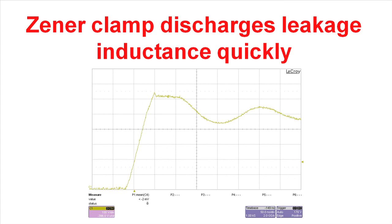In this view graph, we're going to look at the drain voltage of the MOSFET, and we're going to present two different pictures. This first picture is with no resistance in series with the diode — so simply, all we're doing with the clamp is using the Zener to limit the voltage on the drain of the MOSFET. The leakage inductance discharges, you can see the current coming down a little bit, and then you can see where the current has gone to zero. The series diode disconnects the Zener from the drain of the MOSFET, and then the voltage rings — and it rings pretty significantly.